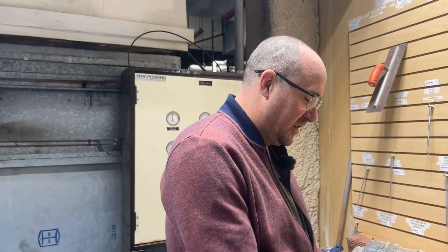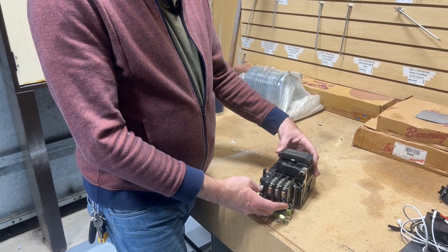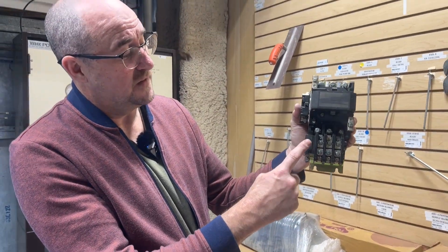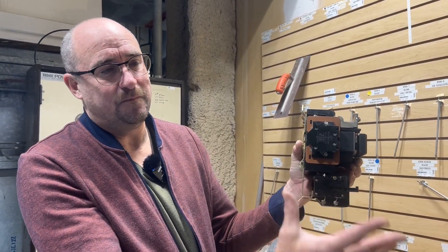Over at the workshop bench, we're going to take a look inside the controller and coil of an MCC bucket. This is basically the inside that we just looked at in that motor control center — it would have been hanging inside that bucket just like this. Here's the reset, here are your heaters, here's your coil, your line side and load side. On the side, these are your supplemental contactors that control your control voltage — they'll be normally open, meaning off, or normally closed, meaning the contactors are making a circuit, and how you have these set up determines how the machine will work.